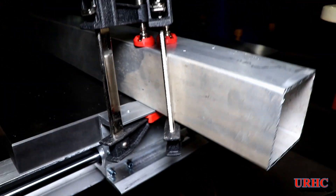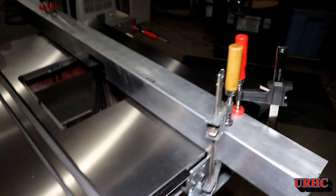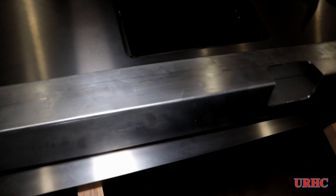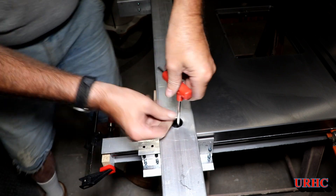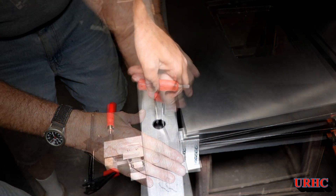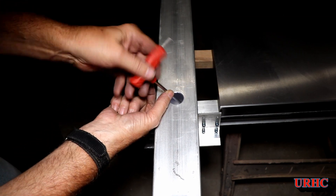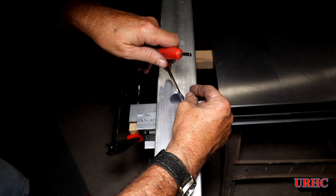A couple hours later I've got my brackets done. Back down in the shop I've got them mounted on the bearings with the fence clamped on just to get my final numbers and make sure everything is running parallel and smooth before putting the final holes in. It really glides right along and everything's perfect. I drilled the holes for mounting and also put a top access hole that will be covered by other brackets later. To get the offset screws in I used a ball-end wrench. Putting tape on the screw to hold it didn't work well, but a little magnet on the wrench made it easy — the screw still floated and I could get the off-center ones in. I've got 12 screws holding it together.